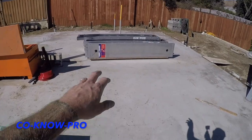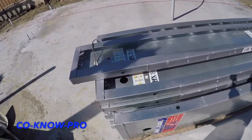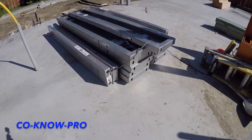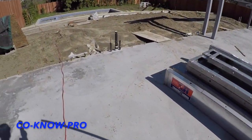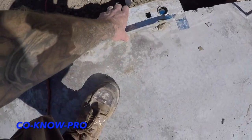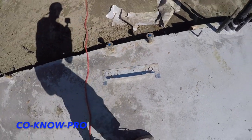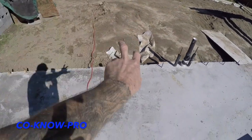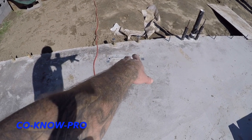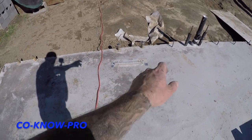When you go to your plans, you can read that — you'll see what the plans say and they'll tell you the schedule. Then you go to your shear wall schedule and it'll tell you. You can see all these Hardy frames right here — these are all the Hardy frames we're about to start getting installed right now. Those steel Hardy frames are some of the main structural supports of the building. They're going to go right here. These are our templates — you take all this down, set the Hardy frame right down, and bolt it all in. I always recommend getting a template, and if you need 14 Hardy walls, you're going to need 14 templates.